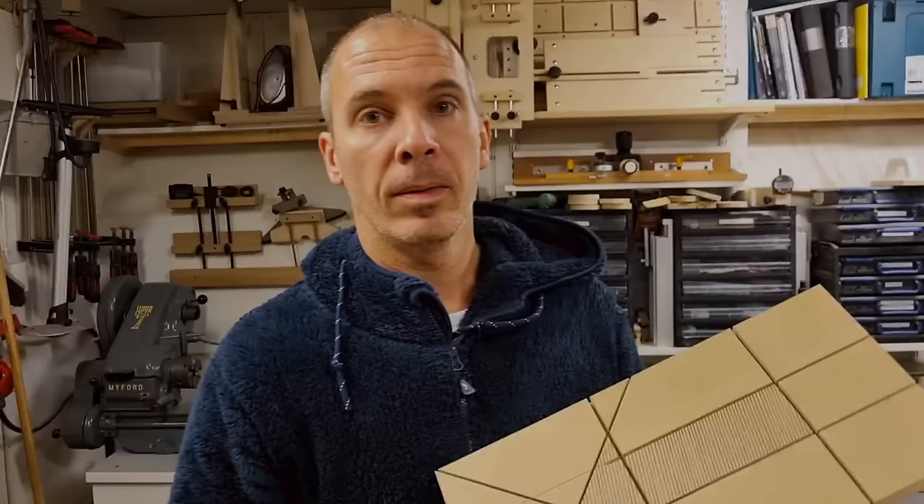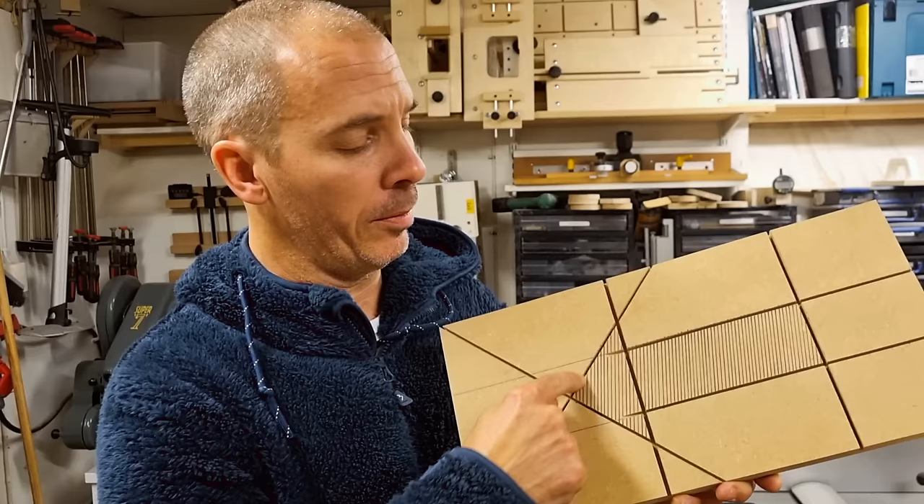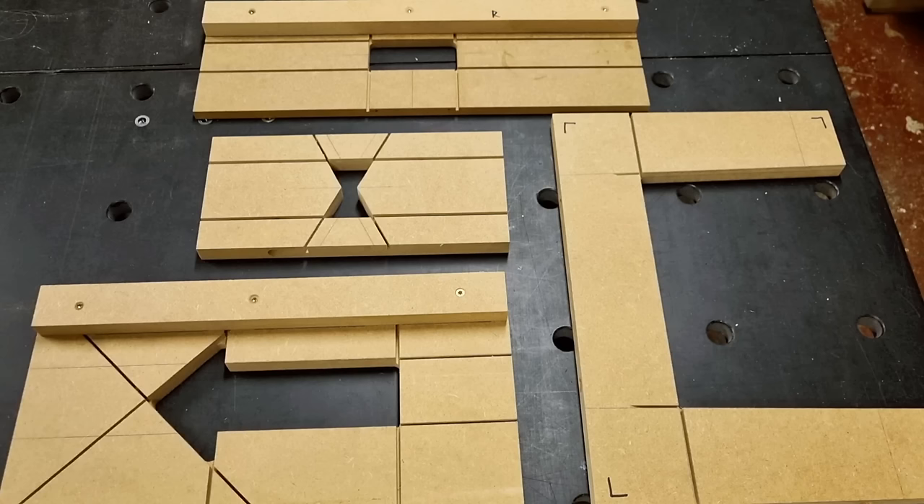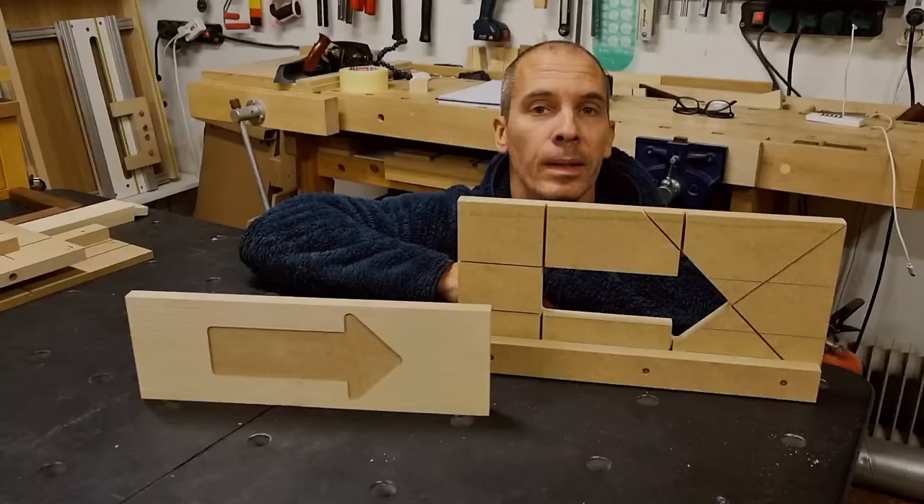The simple trick and magic here are these cuts partially through the material. I call these scoring passes, and these are used to define the outline of the cutout that you want to achieve. Compared to other methods of making routing templates, this is super simple and quick and requires no extra parts. You can also easily make more complex designs with steps and angles.